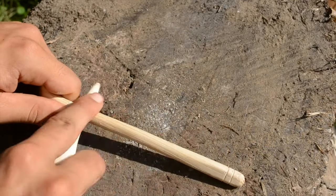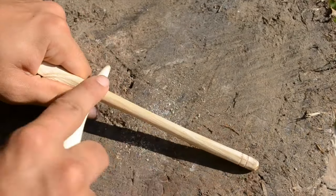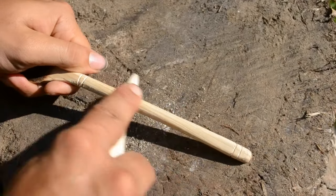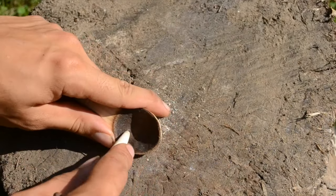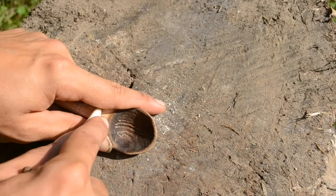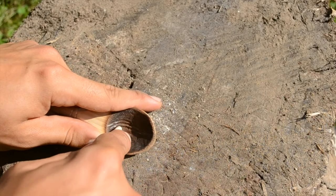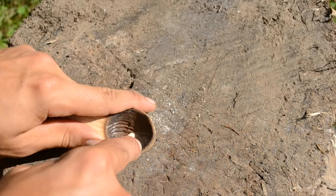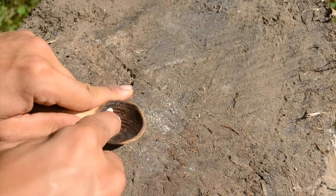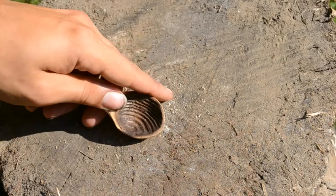Once I've finished cleaning it up I'm using an antler spike to buff the wood, compressing the fibers which will make it shinier, smoother, and a little bit more water repellent. It seemed important to me to compress the inside of the bowl as before it's quite spongy — in theory this will help keep it cleaner, but I don't know, maybe it's better to leave it without compressing. It made all the ridge lines stand up proud. Maybe I should have used a finer grained piece of wood, but what have you — at least it looks neat with the exaggerated grain.